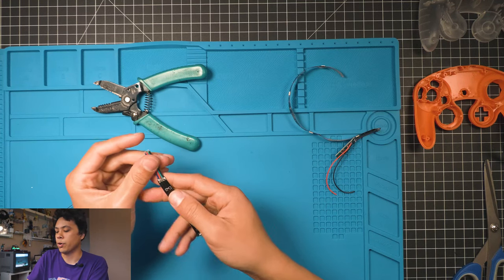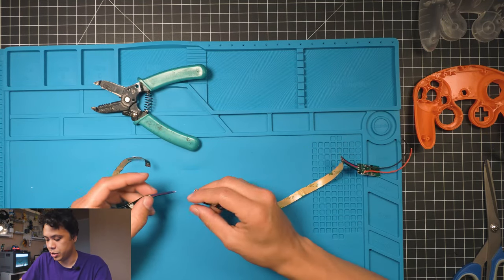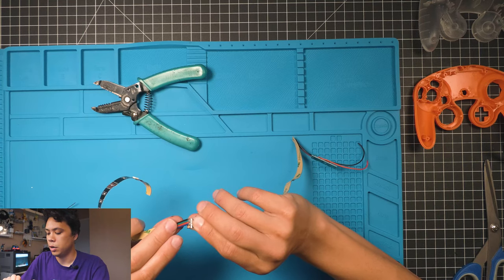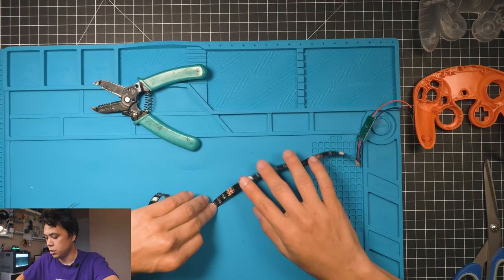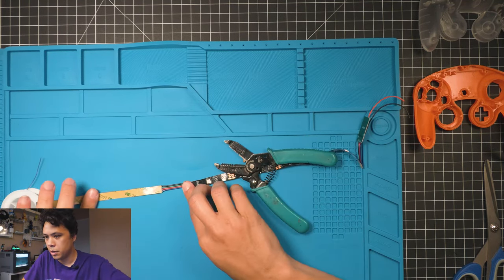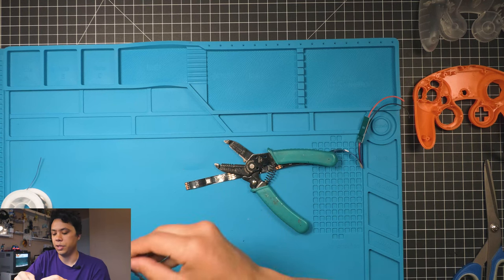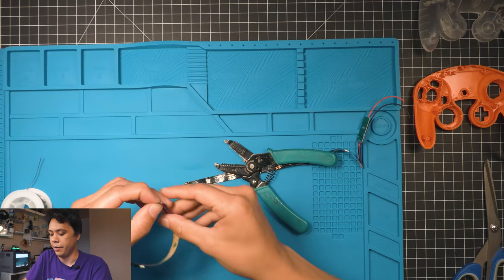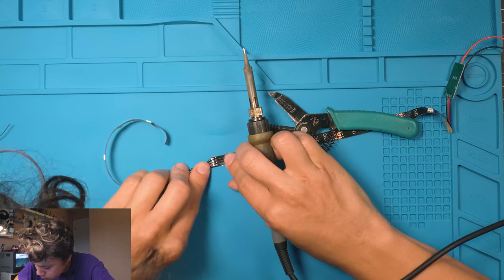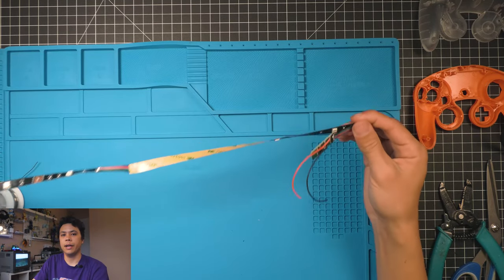This side looks a little more burnt up because this one has the pins on it. It's all good. So now that we have that, we can go ahead and lay that down and double check one more time that these are gonna line up perfectly where they're supposed to go. Blue to blue, R to R, G to G, plus to plus. Let's go ahead and set that down. Same thing. Remember, this is supposed to be upside down like this. And that's exactly how it should lay. And that just helps with the way that the LED strip kind of bends into position. I found that doing this one upside down helps twist that in. And there we go. Now I have our LED strip prepared and ready to install.